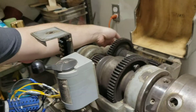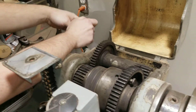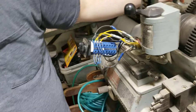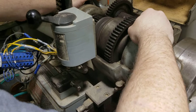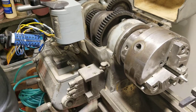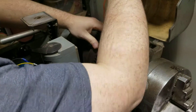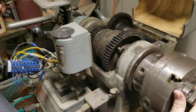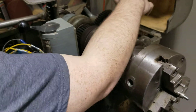All right, so we engage low gear. Locking pin. So once engaged, low gear is engaged. Does someone want to grab that? Warren, can you grab that? You got this pin right here? All right. You're going to let me pull it out. I just put this guy in — sometimes I have to try it out. Just be very careful not to damage the gear teeth. It just pops out, and now you have super low gear. So it's not going to turn very well with the motor not running, but you must disengage this pin to keep it in low gear, or else it just locks.